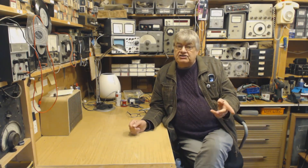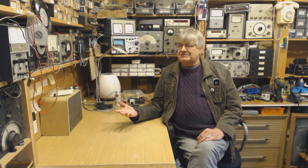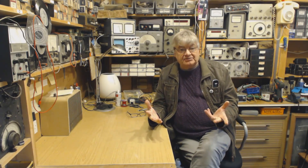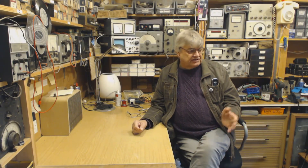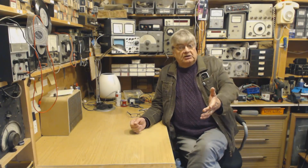The aerial I bought — did you see my aerial video? This is it, the Watson W50. I put that up recently, I think that was 63 pounds. I bought some RG213 — fat, low loss coax — that was about 20 quid. Basically for just under 200 pounds you can get this radio, the Watson aerial, and the coax. You're all set up to go — all you need is a power supply. That's the only thing not in that price: a 12 volt power supply. They recommend about 12 amps — the radio is fused at 10 amps, so you're going to need a power supply that does at least 12 amps. And that's it — you're on the air, VHF and UHF, assuming you've got a licence.